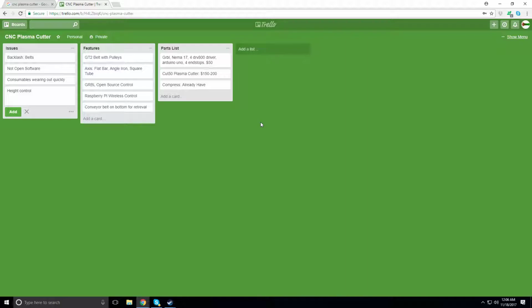Let's say your table is pushed up against the back wall of your shop. Your hand would be going down the x-axis, your y would be going off to the left, and your z is straight up. So your x-axis is straight down the table. Generally, x-axis is the long way, y-axis is the short way.